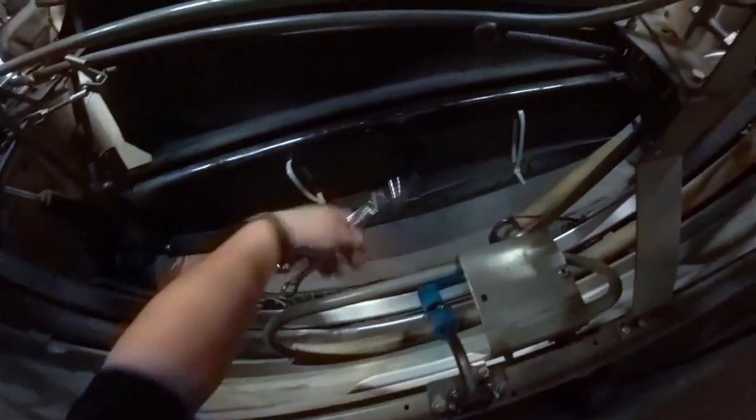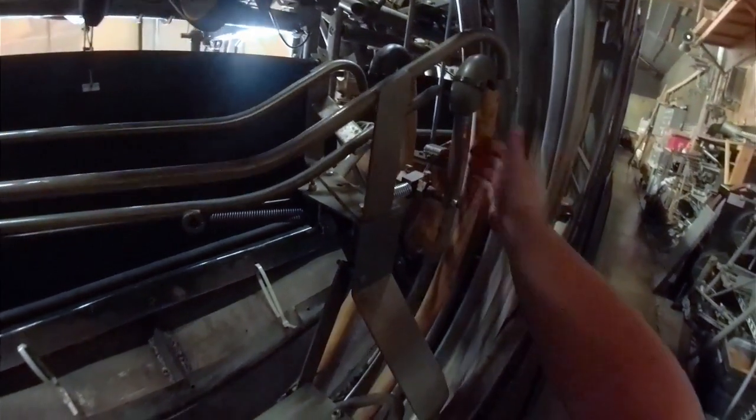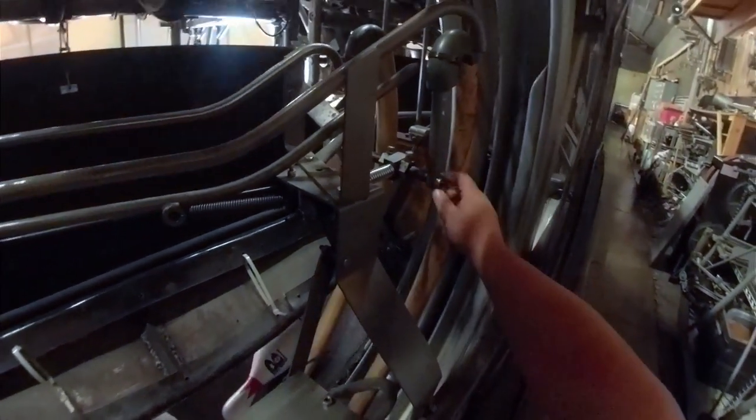I mean, you don't want to be dropping your tools in there while people are bowling. As long as you're paying attention to what's going on around you, you can make your adjustments. There's washers missing here. The problem with that washer missing is the flex that this rod does as it goes in and out is going to be directly on the nut. So this nut's going to work its way loose instead of having that washer in between to give it a buffer. Without that buffer, this will come loose. It doesn't matter how old or how new this nut is, it will come loose.